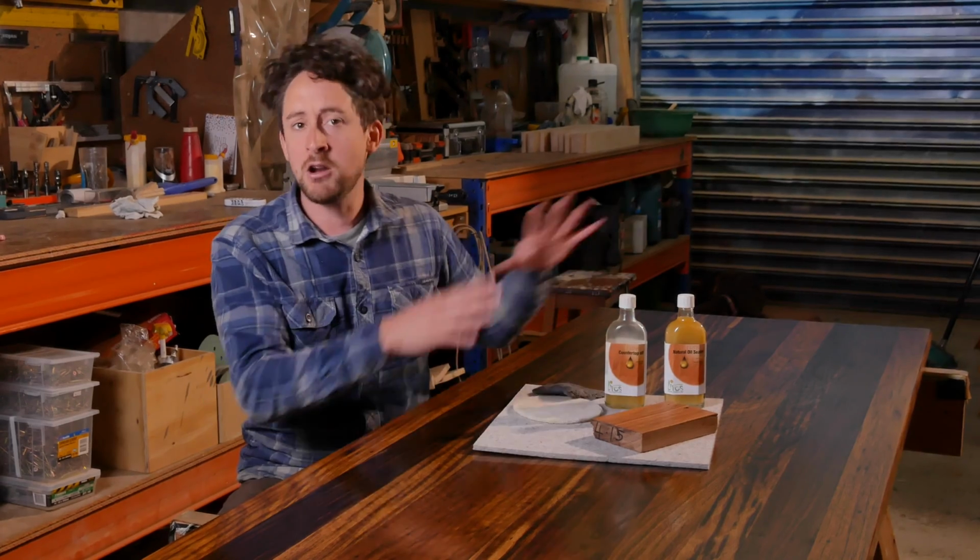The natural oil sealer comes in a couple of colors, so if you're looking for something that has that ability to stain or maintain that natural white color in American oak or pine, they have that range. The countertop oil only comes in clear, but they are interchangeable, so you can apply that first coat of something that's red or white or whatever you like, and then apply the countertop sealer on top if you are looking for that added heat protection.